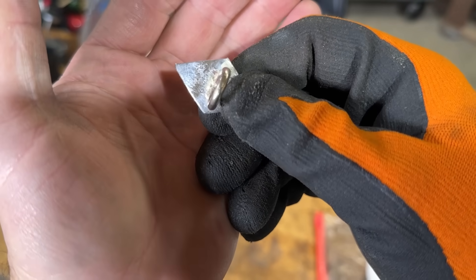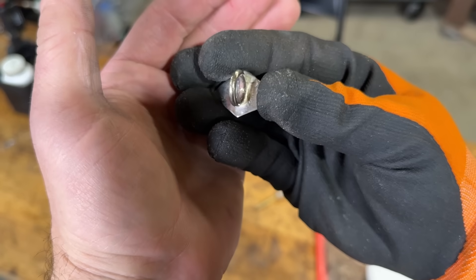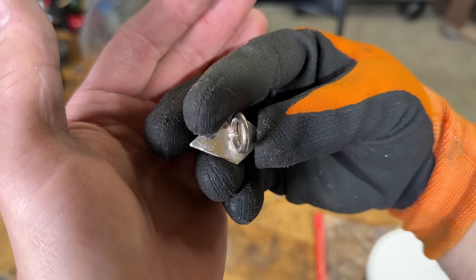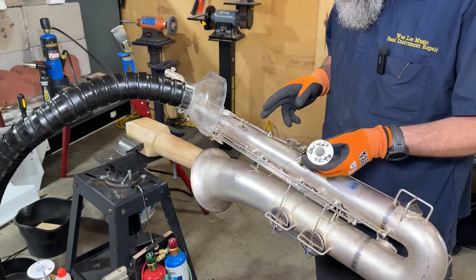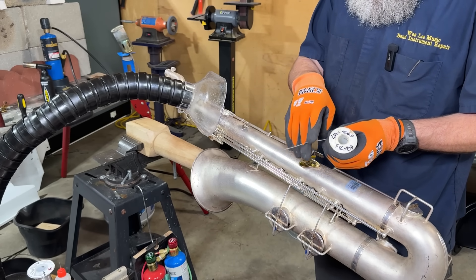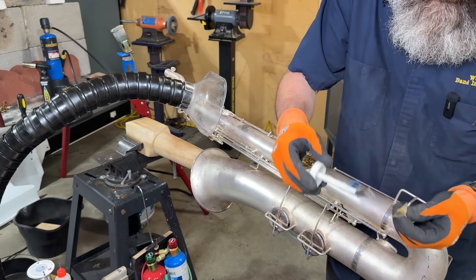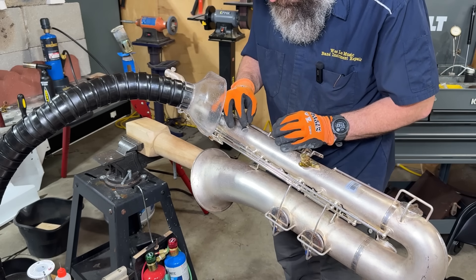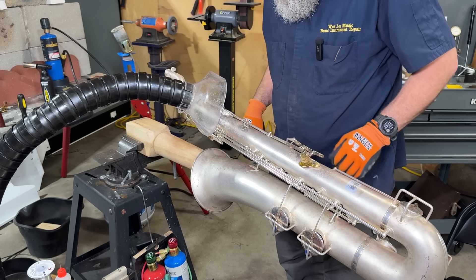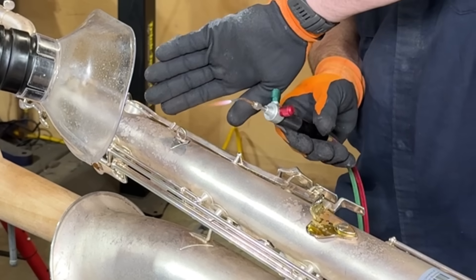Here's our part — saved the silver, got a good joint, didn't burn off the silver. Client will be very pleased. Now I'm going to use low-temp silver to put it back on because it has a white color; it doesn't turn gray like soft solder does.